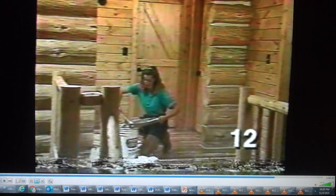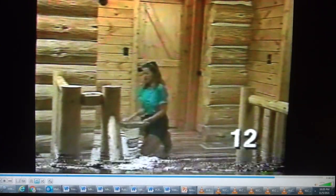Another thing to check is the chinking between the logs. Now, we used a synthetic material that adheres tightly to the logs to prevent leakage. But sometimes, the chinking will crack, or it'll pull apart if two logs settle differently. But we can fix it by just putting in more chinking.